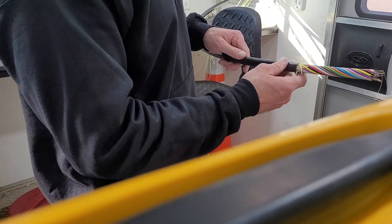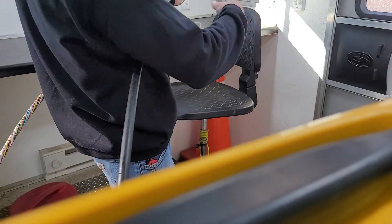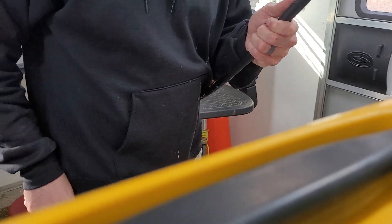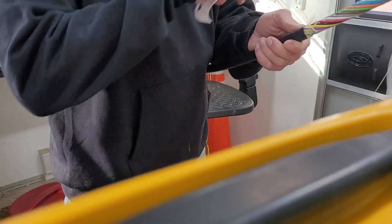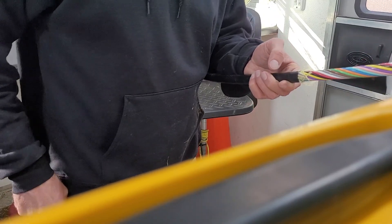Once you do that, it's going to expose a little orange cord — that's called a rip cord. Many of you have probably seen that with copper cables even if you haven't worked with fiber. Once that rip cord is exposed, what I normally do is make a little cut right here. I'm not too concerned with cutting the buffer tubes here. I slice a little cut and that gives the rip cord a starting point. From what I've found, if you just pull on the rip cord straight against the jacket, it breaks a lot. So you make a little slit and it gives it a starting cut.